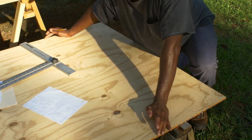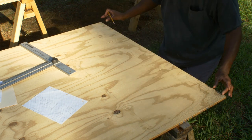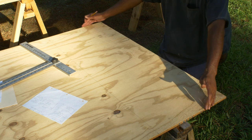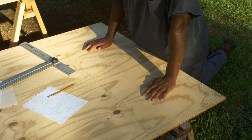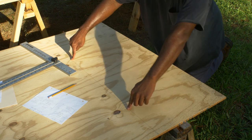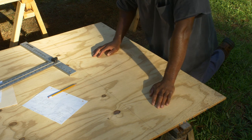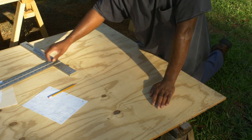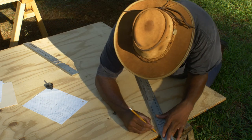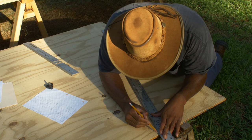Draw your line across — 42 inches at the top. If you want a 40-inch wide boat, just take the width of the plywood itself since it's 48 inches and cut in from the width to a 40-inch wide transom, but you'll need a longer tail. Nine inches in and then three inches down — that'll give us the slant in and down that we need, a smooth angle so the motor can swivel around like it needs to, from here to here.